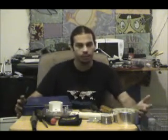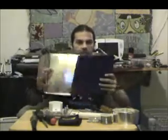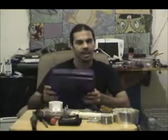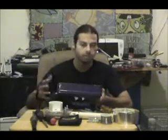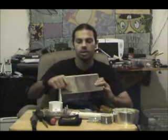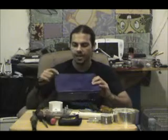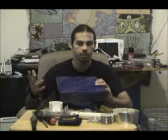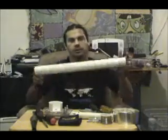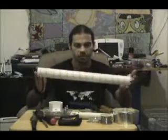We're going to need a reflector, and that reflector has to be one wavelength, roughly 5 inches. You can get old cookie tins — it's literally just an old cookie tin, a good source of metal that's easy to solder onto. If you're going to use it, take some steel wool and scour any points that are going to be soldered, because this metal will rust or they'll paint it. We're also going to need PVC pipe, typically 40mm or 1.5 inch. You can go up to 2 inches, but try to stick with one and a half.